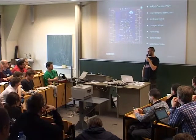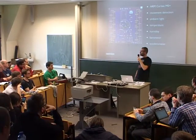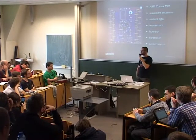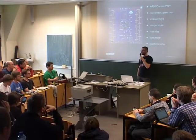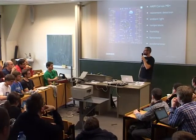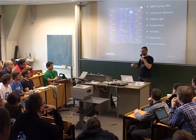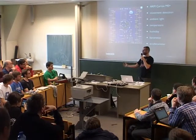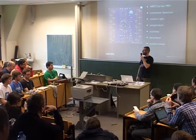What I also like about the JeeNode stuff is that it's fully open — you don't have to go to a special interest group, sign an NDA, before you get the spec. It's fully open, you write your own driver, it's SPI-based, you put it in the mode you want and send it that way. For compatibility, you have a plethora of standards — ZigBee, Z-Wave — but with this approach, once you have it in MQTT you publish JSON on top of MQTT and parse it any way you like. If you want to bridge to another system it's pure software.